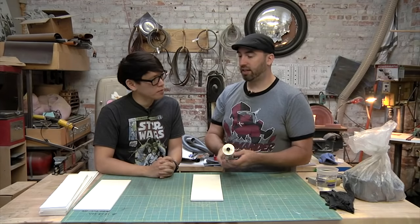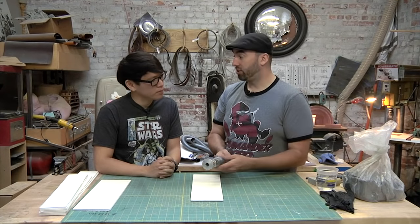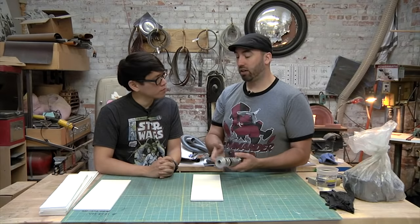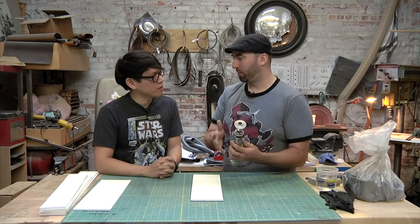And that's one of those things that, with a little bit of experience and looking at other people's molds and researching how molds are made, you can learn how to find your parting lines and how to find undercuts. With silicone, it's really forgiving, so if I don't get the parting line right on the top edge, if it's a little bit one way or the other, it's not going to break the mold.